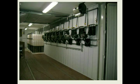Here's a lube storage room. You've seen the picture on the advertisement. This was built for a plant in St. Louis. They had 10 80-gallon containers down here. They brought all their barrels into this room. Each one of these pumps had a lance and a hose on it so they could transfer their different lubes through dual 10-micron beta 1000 filters. So they're basically taking about 99.99% of particles out of their lubricants that are above 10 microns.